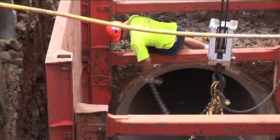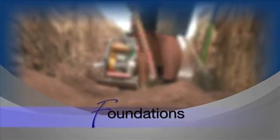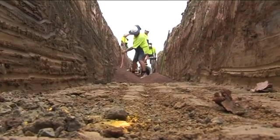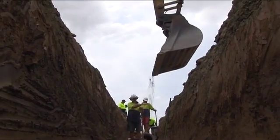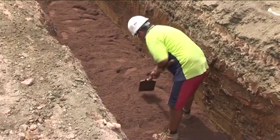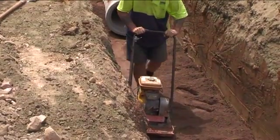Remember, take care on site at all times. The trench foundation shall be free of irregularities and protruding hard rocks. It should be firm and at a level plane to receive the requisite layer of bedding material. Dig too deep and bedding material costs rise; dig too shallow and pipes will not have the uniform foundation they are designed for.